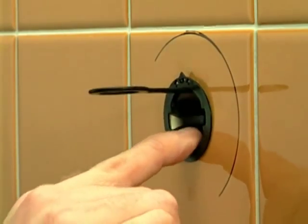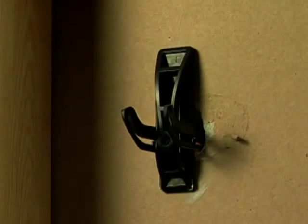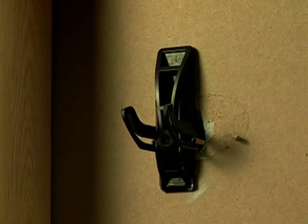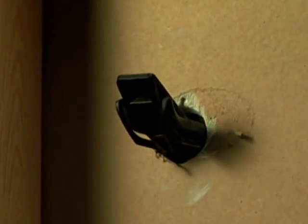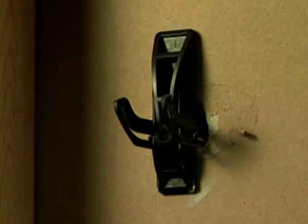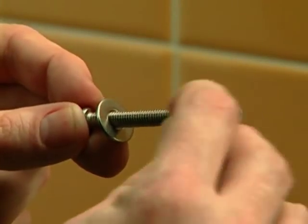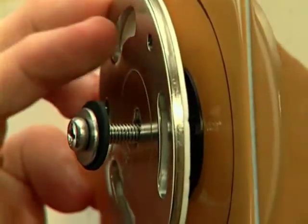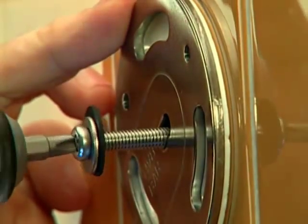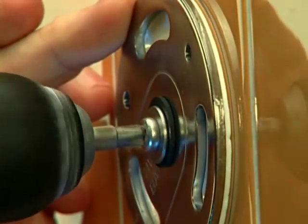While holding the plastic guide sleeve in place, pull the pull tab towards you until you feel the anchor is snug against the inside of the wall. Now remove the pull tab by lifting it up and pulling it toward you. Secure Mount's patented design achieves greater surface contact between the anchor and the wall, ensuring powerful support for the bar. Slide the steel then the rubber washer onto the anchor screw, check that the guide is still in the 12 o'clock position, and tighten the screw and washer through the center of the mounting plate into the anchor.